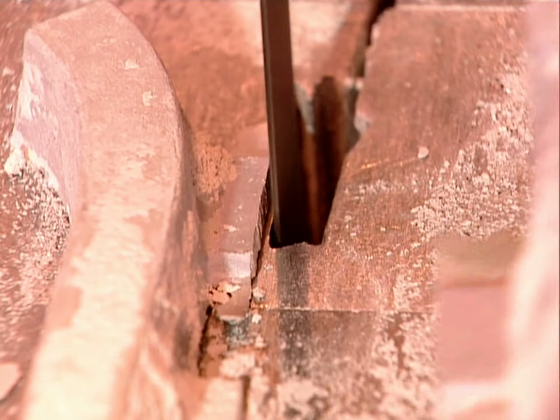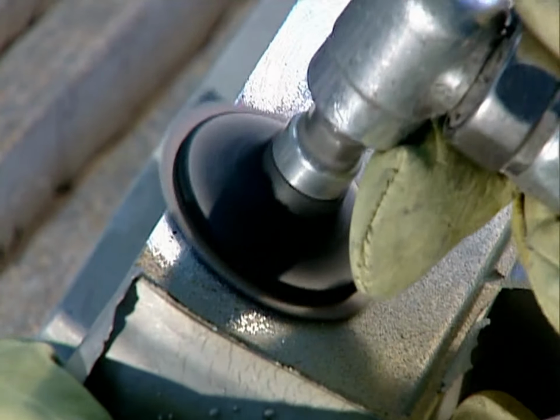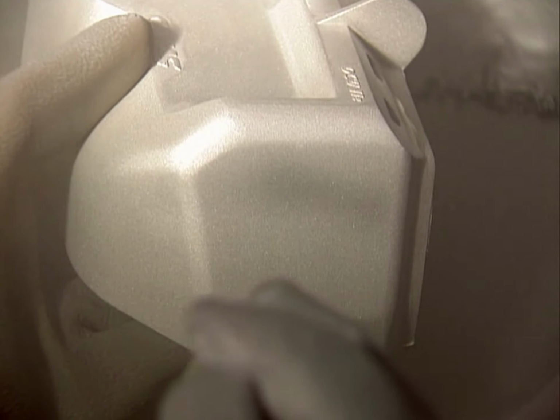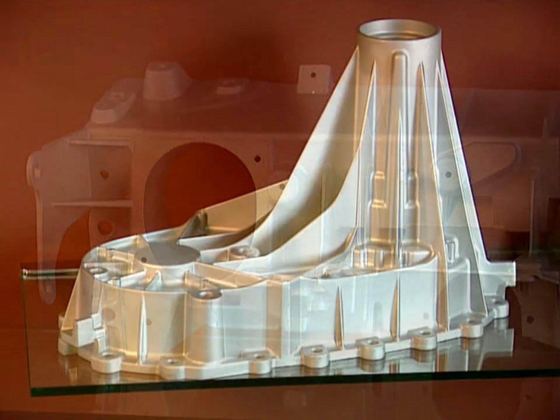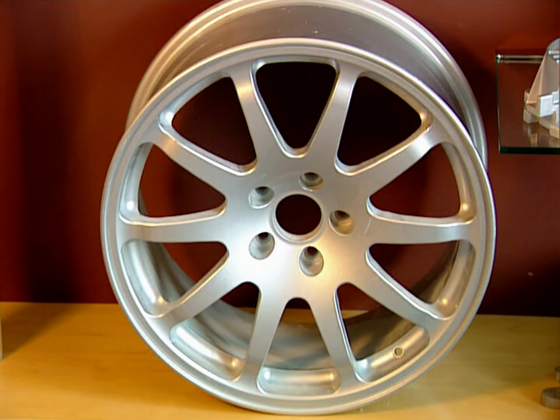They cut off the channels through which they poured in the metal and polish the part using grinders and sanders. Then they paint it using special spray paint that adheres to magnesium. The part is finally finished. It takes several weeks to prototype and tool metal machine parts. When you think about it, even the machines that make these parts are made of parts that were created with this method.